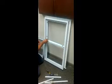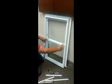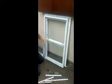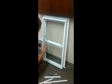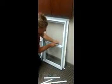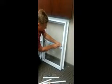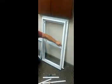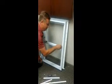Now make sure that your setting blocks — which are these little rubber blocks — are back in the position they're supposed to be. They should be in about an inch and a half from the ends, and they've got them on one side too. If there are big gobs of excess silicone, just clean that out. Take your chisel and you can kind of clean it out a little bit. Most of the silicone came out; they didn't have a lot of silicone on this one. Depending on how much silicone they have, it may be harder.